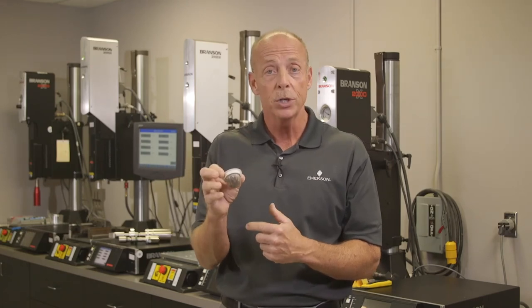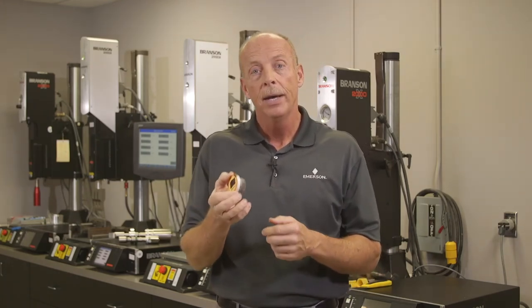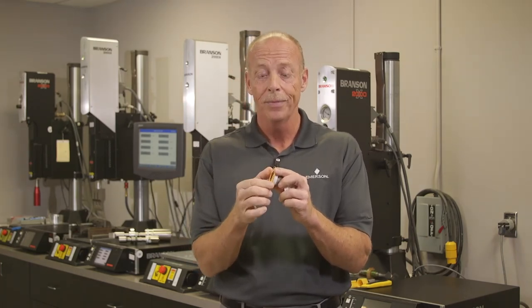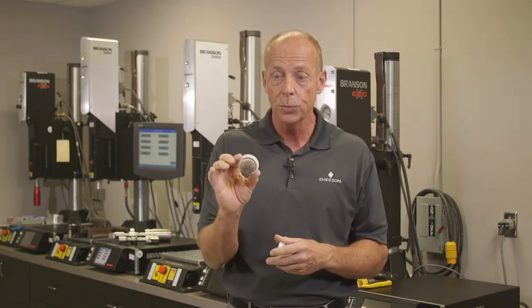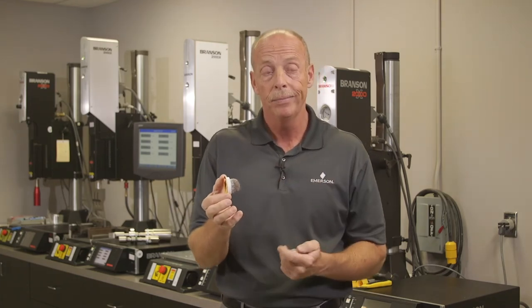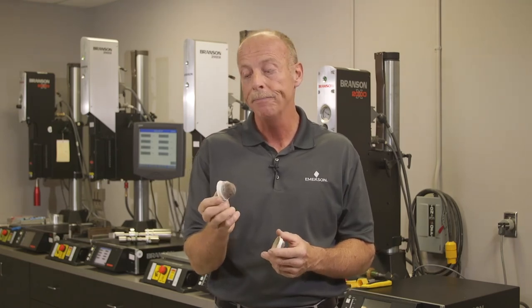Traditional heat sealing was the method of choice initially. Bio-based materials have a narrow processing window. Overheating and degradation is a very common problem with conventional heat sealing. That's exactly what happened with this one. Leak paths were created and it was unacceptable. Additionally, there were cycle time challenges using conventional heated tooling.